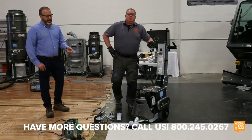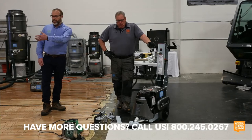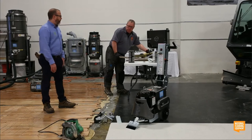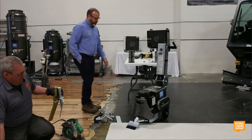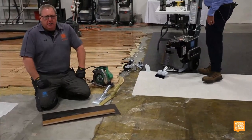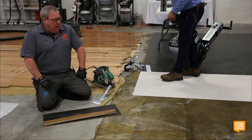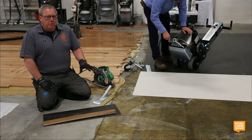Another great feature on the Gladiator is that the shanks and the blades swivel. It's a built-in swivel head, just like on our riders. A swivel head attachment is also available for our smaller walk-behinds and the Commander. This allows you to stay in the work because that blade or shank is going to swivel and stay flat with the concrete. The next question that directly relates to removing hardwood flooring is: why does National have so many shanks? We're going to talk about the hardwood shanks and the differences between them.